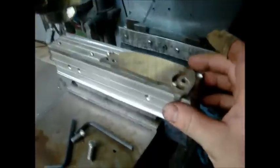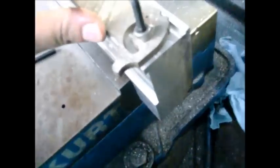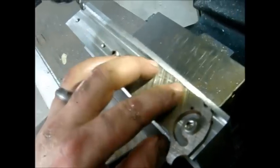So over to the mill. Got my jig set up here. I tried to make this jig as simple as possible — I butt it up against this lip right here on the back, put my two bolt holes and bolts in. A little hard to do this single-handed, but you get the idea. Get it not tight, just loose. Thread it all the way in, then push it up against the outside and tighten her down. There's a line right in here — there's no gap. This is indicated off the top most portion. And when you flip it over, you get the exact opposite side, minus the angle. And then when you grind it flat, it straightens out.